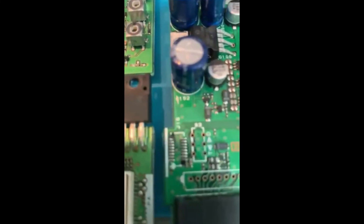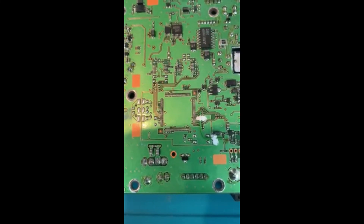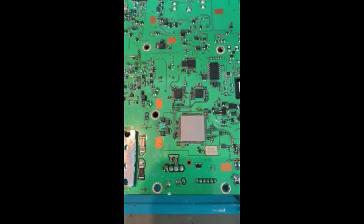The reason those are gone is that the DSP on the D version is actually mounted on the back side of the board. Since I had the two boards out for this video, I'll show the back side. Here's the non-D version — you can see the footprint for the micro but the micro is not installed. On the D, it is installed. This is the actual DSP chip, which is obscured because there's a heat sink pad glued to the top of the DSP — it helps eliminate the heat generated by the DSP running. So you can't actually see the chip; you just see the silver pad glued to the top in this picture.